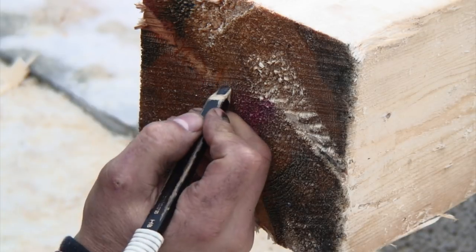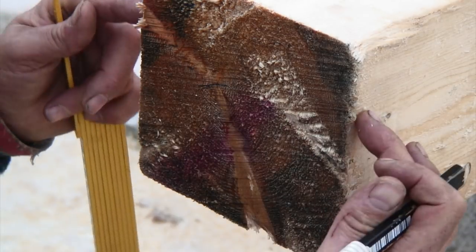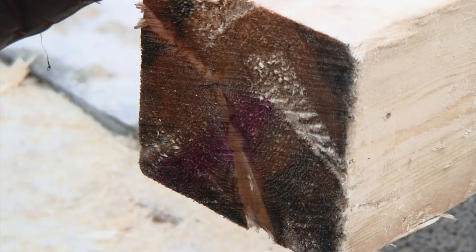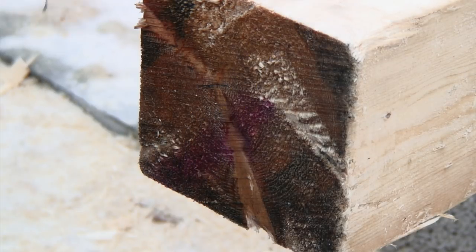Now all the pieces of timber have that slight crack, and what that means is that if it's going to split somewhere, it'll split along these sides, and that's desirable, that the splits are on the sides and not on the top. Because if it gets a split on the top, that can fill up with water and make it rot. So that's just a little top tip.